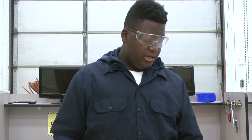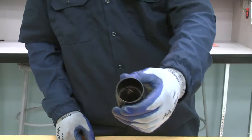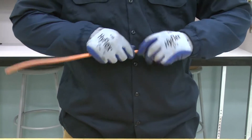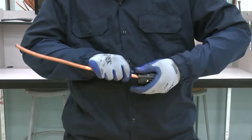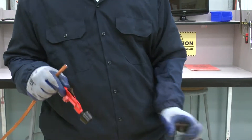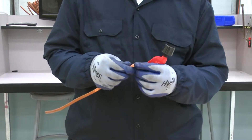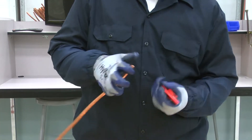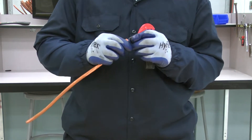After you cut your pipe, what you want to do is reaming. Reaming is when you clean out the burr from the inside so it's smoother when you put the pipe in place, because if you don't ream it, it's going to cause leaks or restrict gas flow. There are many different types of reamers — this one is much easier to use. Even after reaming, sometimes there are still metal shavings on the side, so you go back over them and make sure those are off.